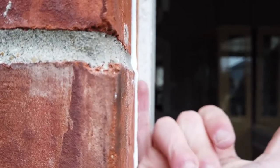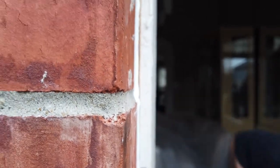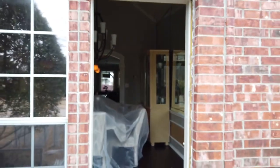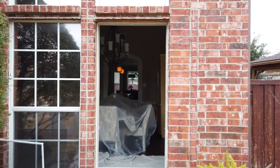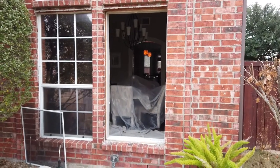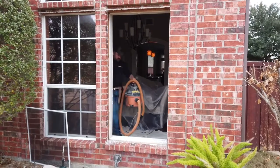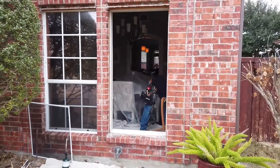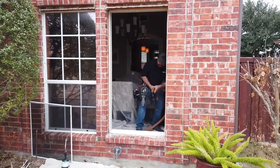The new window is going to sit right up against that drywall. The exterior opening is a little larger than the interior opening, which is also why you measure the window from the exterior. That said, sometimes in what we refer to as an offset window, the inside opening is actually wider than the outside opening. But for the most part, especially on a brick facade, the exterior opening is wider than the interior opening.